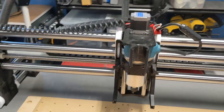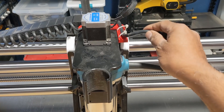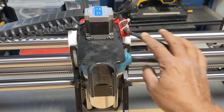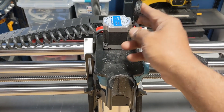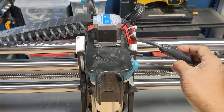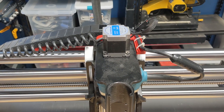All right, EMI — what is EMI? EMI is electromagnetic interference, and that's often caused by a high-current wire like the power cord for this Makita router traveling near lower-power wires like the stepper motors have here. It is magnetic interference created in this wire that can wreak havoc with signals to your stepper motors.